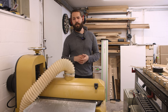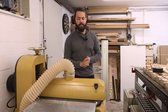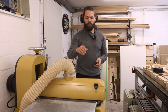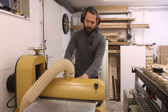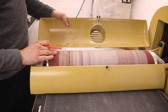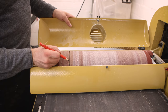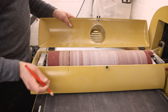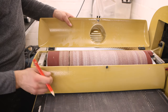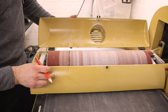One more thing: from time to time you will get burn marks on the sandpaper of the drum. They will pretty much ruin your Kumiko strips. I'm too lazy to change the sandpaper that often, so what I do is open the drum cover and check where the burn marks are. If I feed a Kumiko strip right over a burn mark I'm going to have a black strip. So I just make a pencil line there so I know not to insert a Kumiko strip in that spot — that still gives me plenty of room and I don't have to worry about ruining a strip.